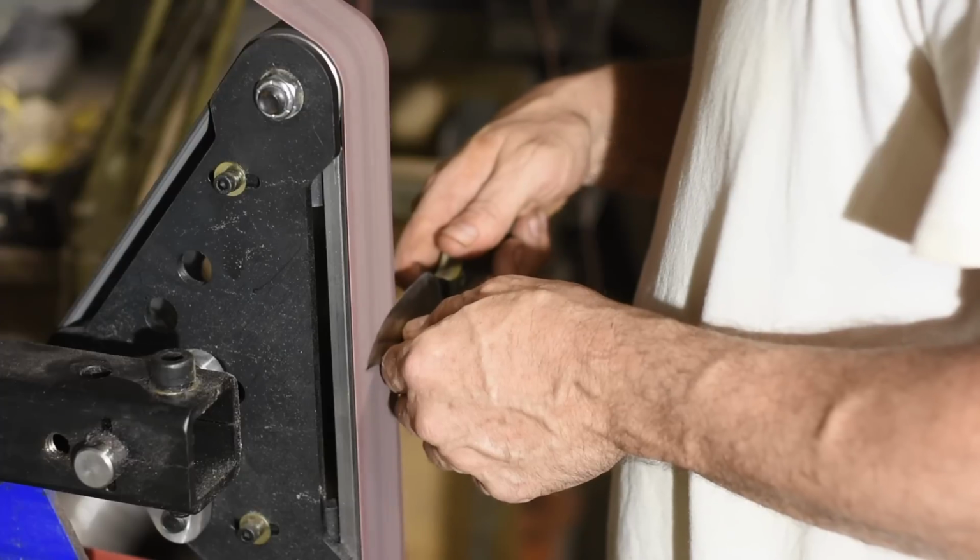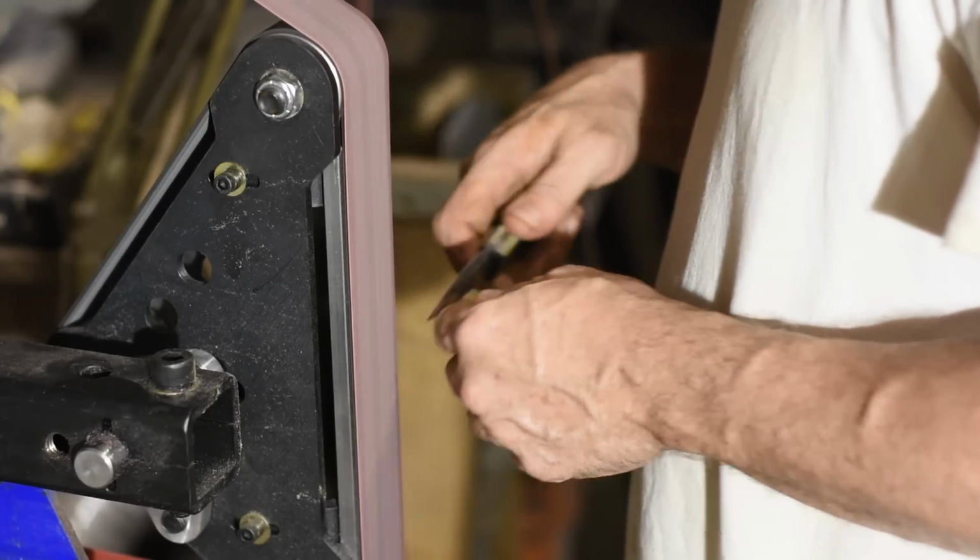Now, putting aside the issue of blade thickness specifically, the two biggest things that you as a knife maker can control with respect to sharpness are the steepness of the bevels and the thickness of the knife at the edge before sharpening adds in the micro bevel, which is the little sharpening that you do to make that final edge. Now, unless you're talking about specialized knives like sushi knives that are asymmetrical, you always want your bevels to be symmetrical. That is exactly the same on each side of the knife. So let's start there. The way to get symmetrical bevels is to keep the blade at exactly the same angle when you grind. You don't change your bevel angle at the tip, you just gently cant the knife out from the grinding surface as you grind. But the bevel angle stays exactly the same. So if you do it that way, you'll get even grind lines and a consistent edge thickness.